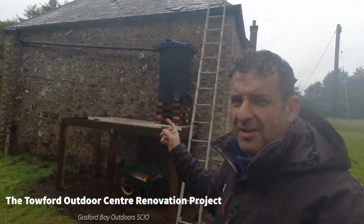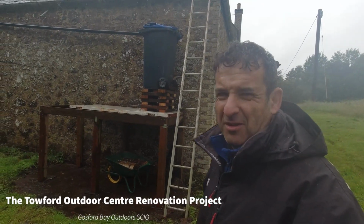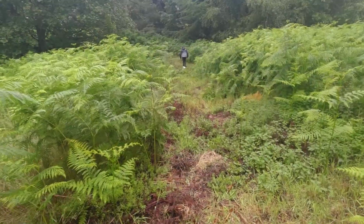Afternoon, and it's a damp afternoon, but this is good because it means we're having water coming down on the ground. If you look here, I was there yesterday, and as you can see, our wheelie bin is already filled with water, which is really good and really bad because we've not actually drilled a hole for the outflow pipe, so we're going to have to empty that. However, proof of concept does work. We're now going to go up and have a look at the water tank to see if it's filling up. Let's go and find out.